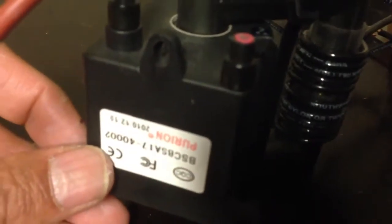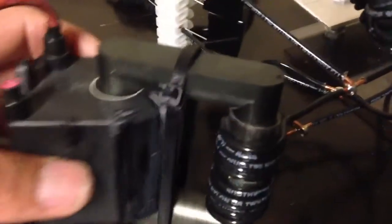And then what I'm doing for the tank circuit, got this AC flyback here, and this is from Amazing One. They make great flybacks, and I've got 4.5 plus 4.5 turns on it, so a total of, I believe, 9 turns, a 12 gauge on it. And then I have a bunch of 0.47 microfarad capacitors all connected. This is series parallel, so 0.47, 0.47 times 3 banks of capacitors.